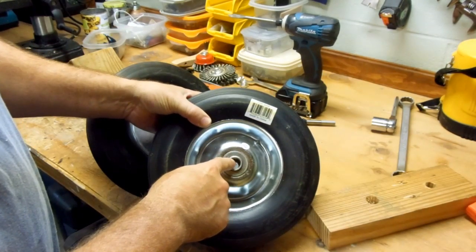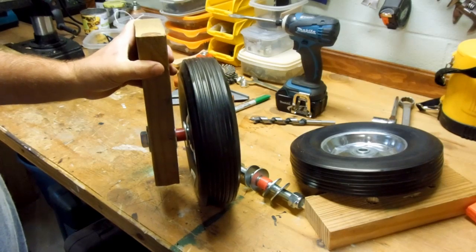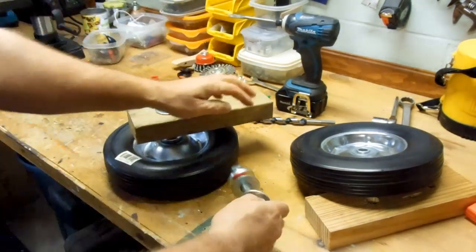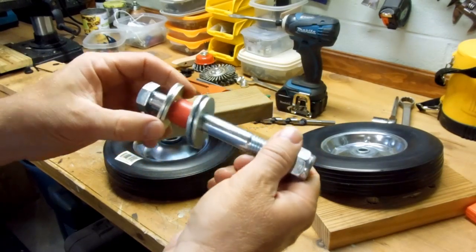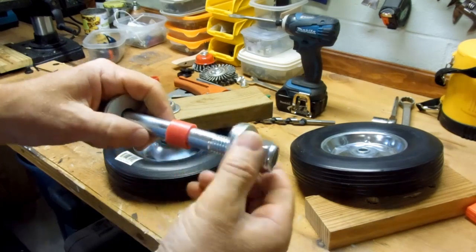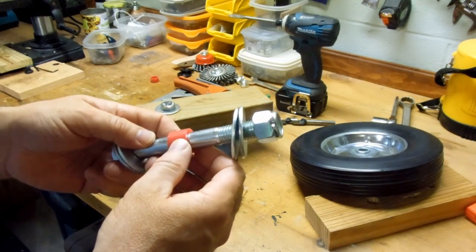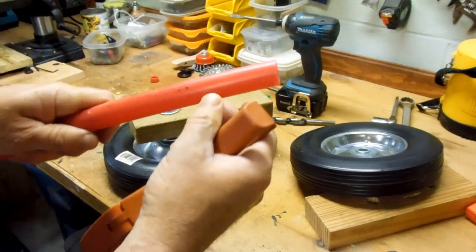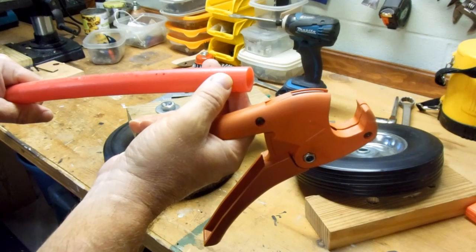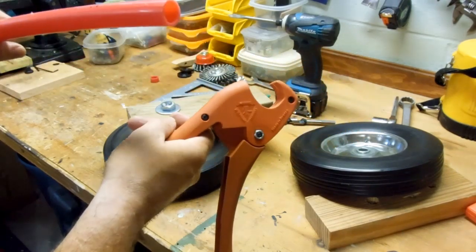The diameter of this shaft is 5/8 of an inch. I've created a little mock-up of what it's going to look like once we mount it onto two of the four legs on the table. We're going to come through with a 5/8-inch bolt that's 5 inches long, use four 5/8-inch washers, and a nylon lock nut so it doesn't move on us. There's also a little spacer I made out of a scrap piece of 3/4-inch PEX — that's just the new flexible plumbing tubing. You could cut it easily with cutters. If you don't have any PEX, you could use any 3/4-inch pipe — copper or PVC — or your local hardware store will cut you a piece for next to nothing. You only need 5/8 of an inch on each side.